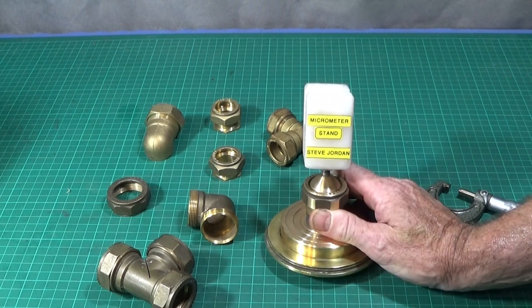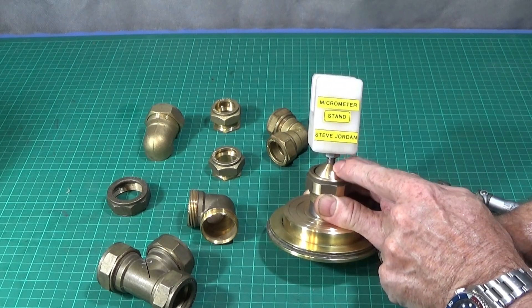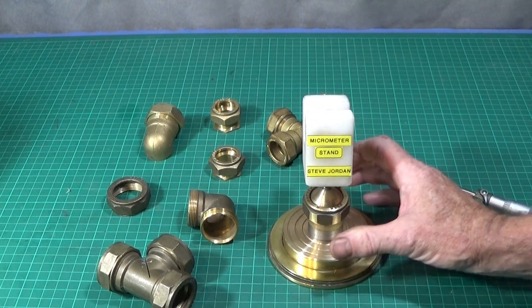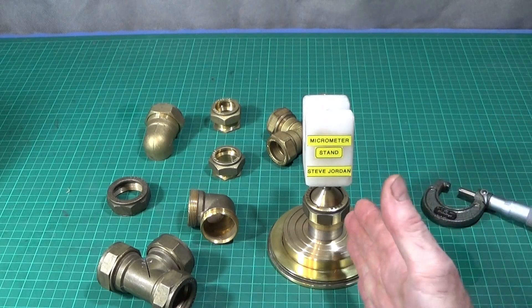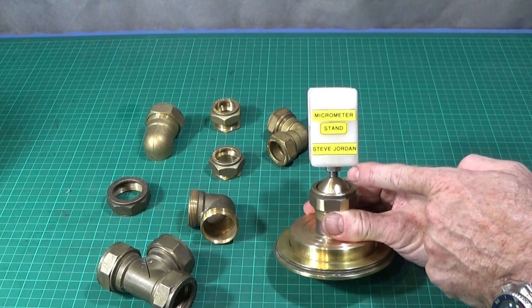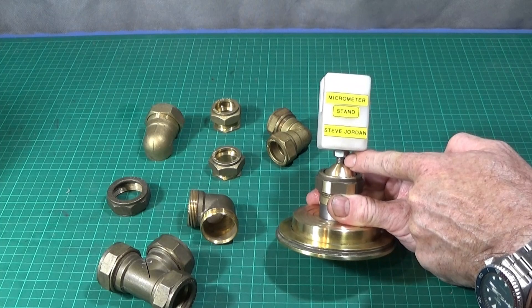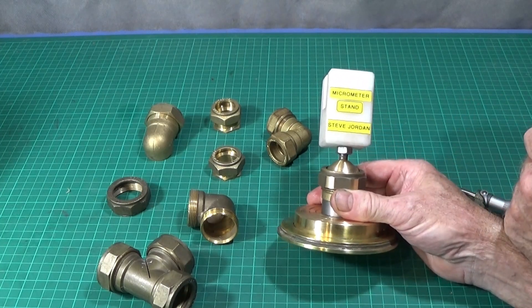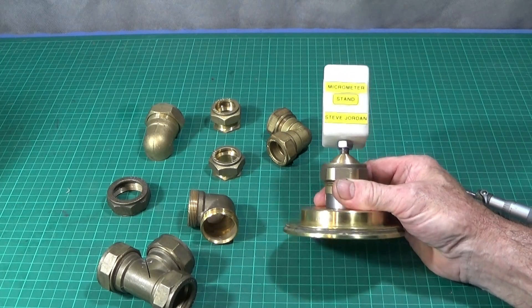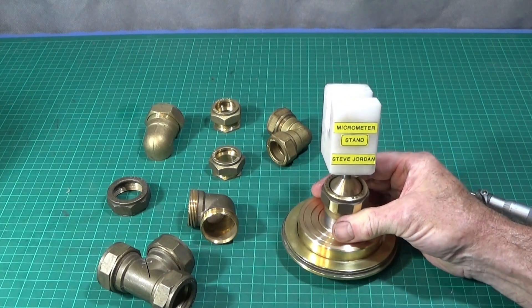When I turn these balls on the Myford ML7 I first drill and tap them part way through with an eight millimeter thread, so it goes on my turning fixture. The bar screws on the turning fixture and then I use the ball turning fixture to machine it. I keep that eight millimeter thread for some stainless steel stud which screws in up to the stop — enough to screw into the underside of the polythene part and then lock up with a lock nut. So the thread has two uses: one for the fixture and one for the finished component.